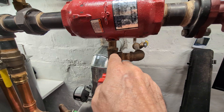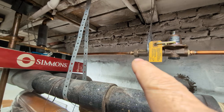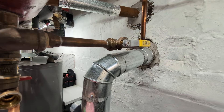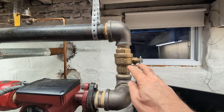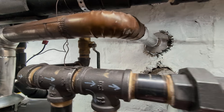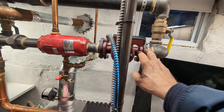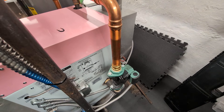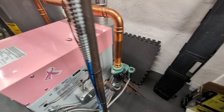This is also where the makeup water is fed. We've got an isolation valve, a backflow preventer, and a boiler feed. Then there's another isolation valve so any of these components can be serviced or replaced without draining the system. We also have a shutoff valve so that if the circulator needs service, we can isolate it. If I was going to do this again, I would probably add shutoff valves built into the flanges so the least amount of air is induced in the system and you don't have to drain as much water off to service components. But overall, this is better than most systems.